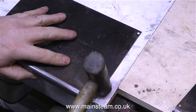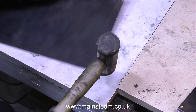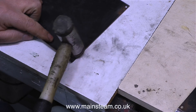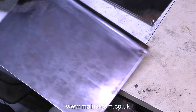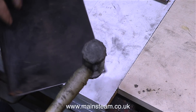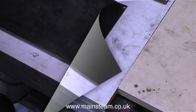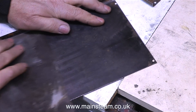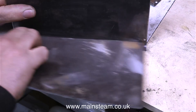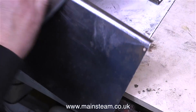There's also some distortion around the holes, and the reason for this is quite simple. The inside edges of the cast iron parts of the boiler mounting are not square — they're actually rounded a little bit, because these side panels were originally designed to fasten two pieces of asbestos to the cast iron parts. At some stage in the past, whoever put the boiler together over-tightened the bolts a little bit and crushed the asbestos, causing the parts of the side panels immediately around the holes to become concave. And that's what I've been doing with the hammer — I've been flattening them again.